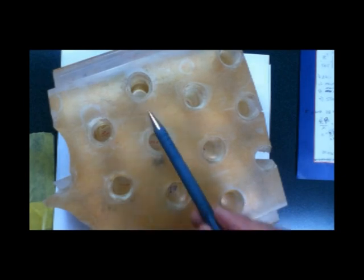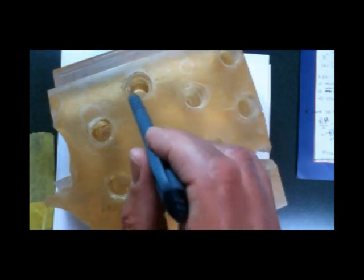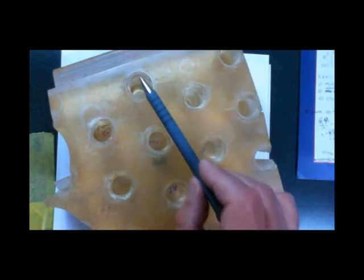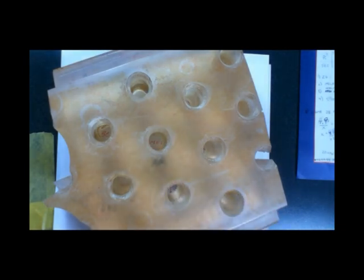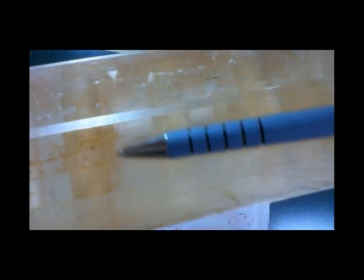It's got a series of offset holes. The holes in this original baffle plate are five-eighths of an inch in diameter — the small through holes. The other hole area at the end, as it leaves the baffle plate, is an inch and a quarter wide. It's a big thick piece of acrylic — you can see when I hold it sideways that it is quite thick. This top edge from here down is one inch, and then from this edge down is one and a half inches. This edge right here has been chamfered — you can see it's a 45-degree slash on the side — that's to make it so it's not sharp.